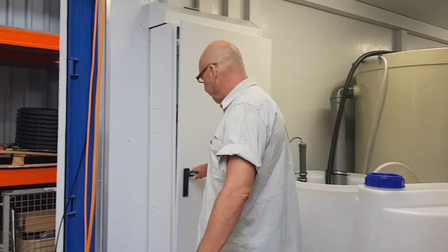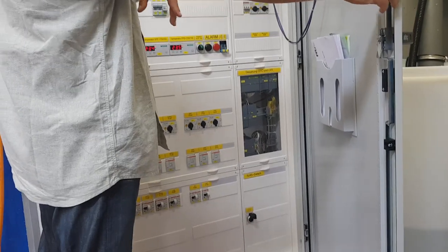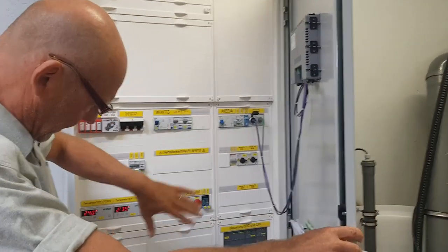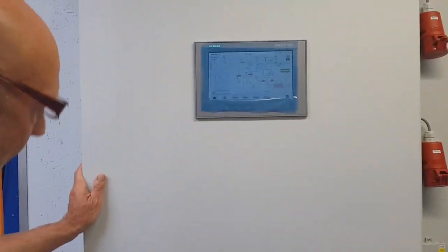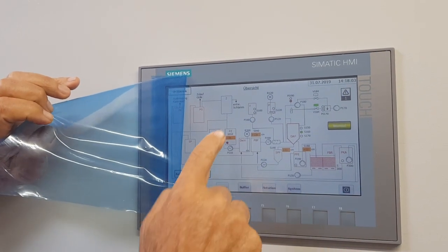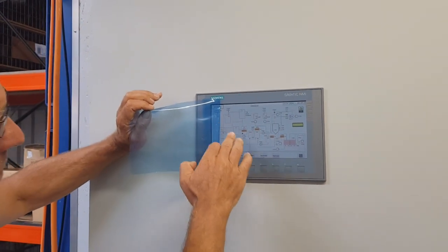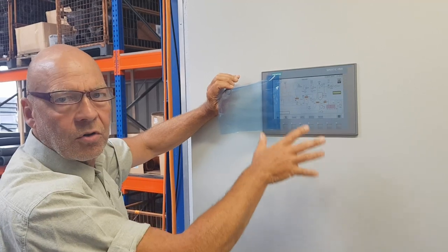What we see here is the main control unit, control box for the whole system. For other container components, for example, there is also included a small biological system and buffering of the wastewater — all these devices are here together in one control unit. You see the control panel: it is a touch panel for the different components such as a flotation system, the sludge treatment and the fixed bed reactors which is a biological system, and furthermore all the pumps and sensors are on this display with different menu points to switch through the control unit.